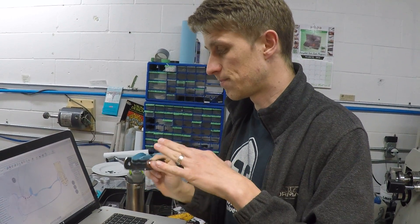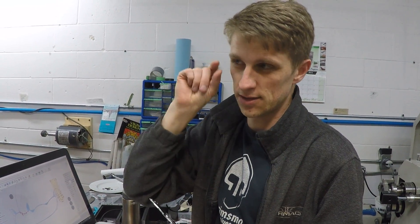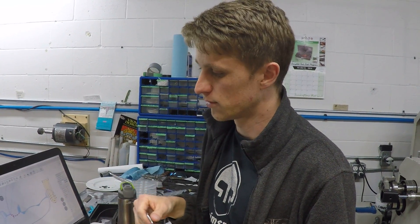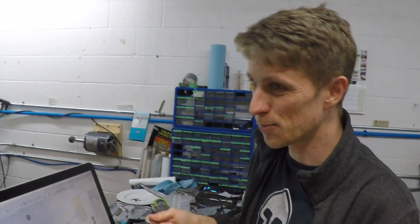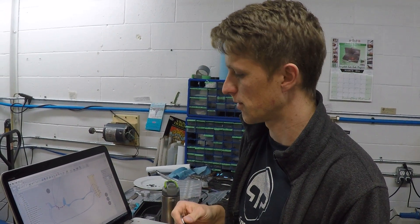For such a shape that's all swoopy and was originally derived from a spline where you can grab a point and move it, you really have to make an effort to get this as smooth as possible so that you have the best product possible and Eric's job is a lot easier with less finishing work — because it's stupid to machine a part that's not great and then have to redo it afterwards when the machine can do a great job anyway.